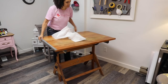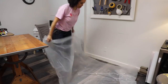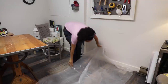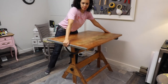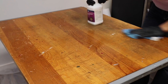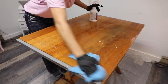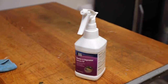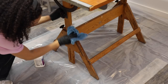The first thing you want to do is put some plastic down on your floors — this is something we're going to do indoors, so that'll prevent a huge mess. Stripping is a messy job, but it doesn't mean you have to do it outside if you're using products like Blue Bear that you can use indoors. Even though we're going to be stripping, as a good rule of thumb, always clean your furniture first. Even if you're stripping, you're going to strip away the dirt, but it's probably best to clean it. Look how dirty that is — it's got my kids' dirty handprints all over it.